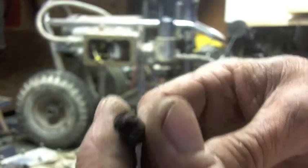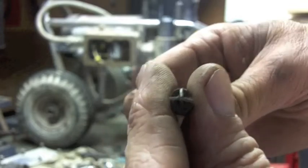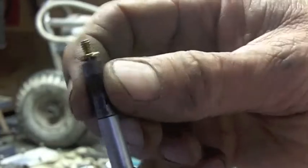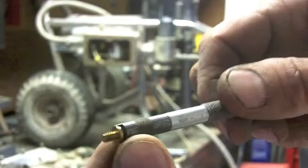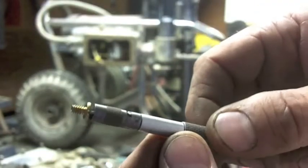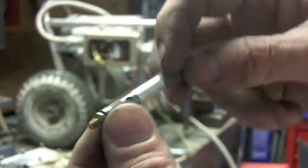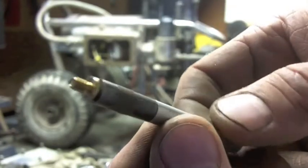And the Phillips heads kind of do the same thing. You put your Phillips in there, you snap it into place, and they spring hold on until you get done with it and you can pull them out. Pretty cool for reaching them tight little areas. You old school hot rodders, I remember points and condensers, when you had to put them little bitty screws that hold the condenser down to your distributor plate or the points. That's what these guys work perfect for, because you got to do this. And they're brass. In this case, magnetic wouldn't even work.